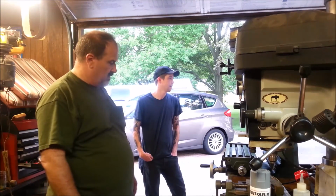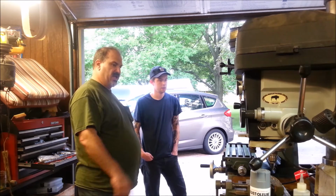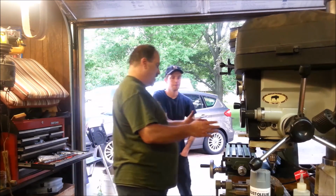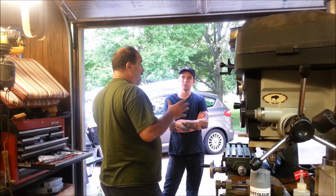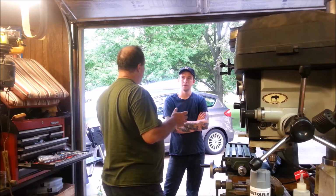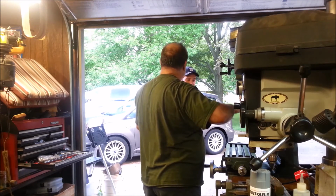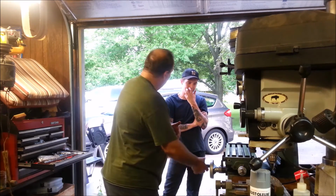You don't have a mill vise that you want to sell, do you? I don't know. That's a 3.5. I think a 3 to 4 is reasonable for this machine. The problem with the bigger vises, like occasionally I'll see a Bridgeport vise for 100 to 150, depending on how chewed up it is. But I've seen people buy those things and the thing's this tall, and you start to run out of Z. It's just ridiculous. It's in the way, hanging out past this.